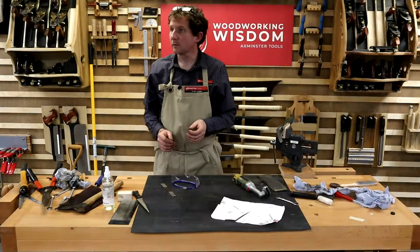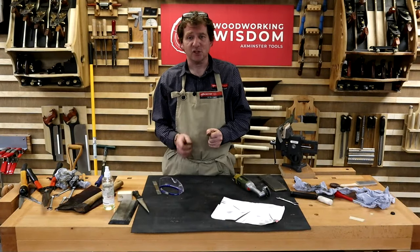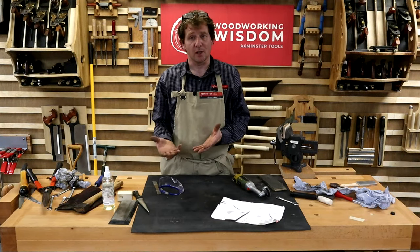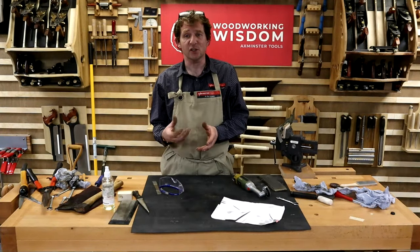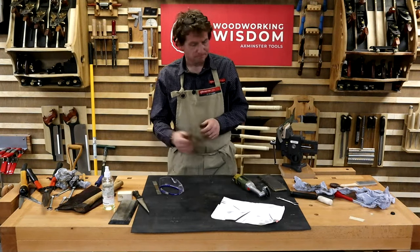And what oil would you recommend? I think we do an Osmo garden furniture oil, that sort of thing. So something that is designed for exterior use, that's important. No point in going just with a finishing oil if it's designed for internal use, because it just won't last in that environment. So have a look and make sure you get something I would class as an exterior garden furniture oil. I know there's an Osmo one. We do things like decking oils, so those sort of things.